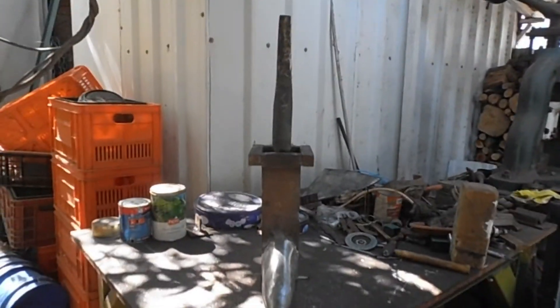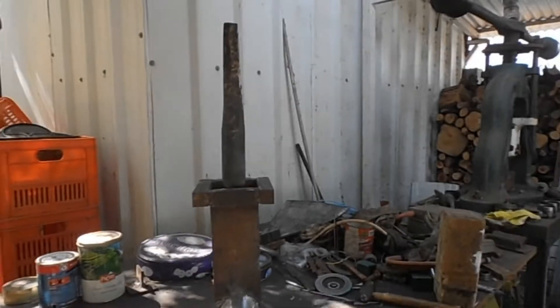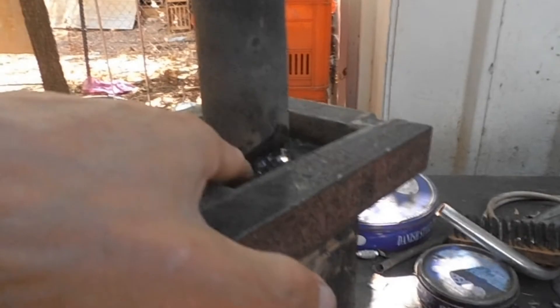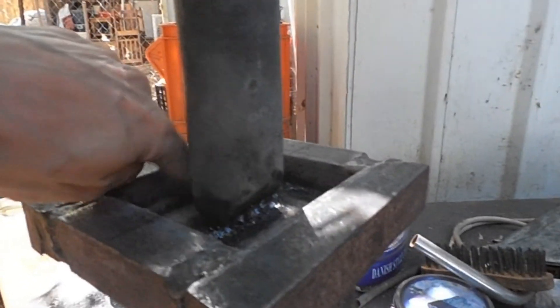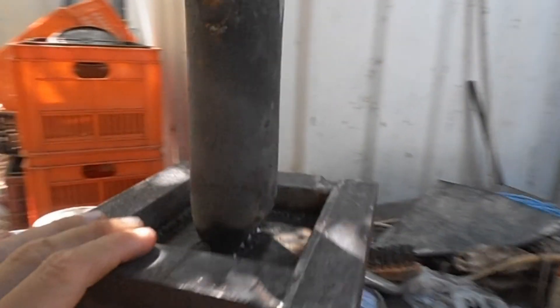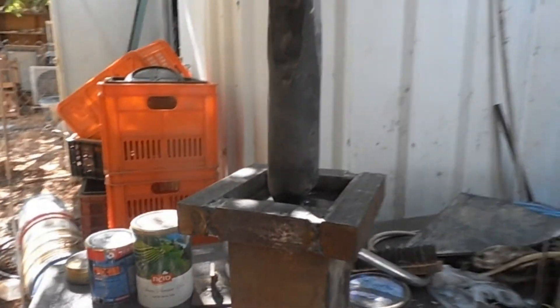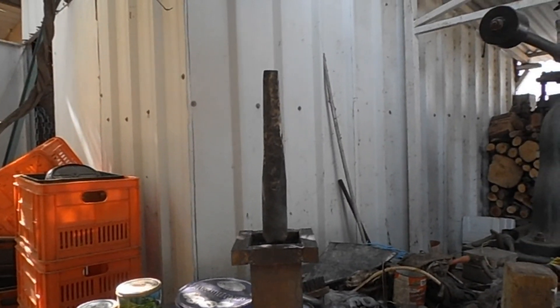As you can see now, it's also not symmetrical here in this spot. I'm going to weld it over here — I cut these two chamfers so all of this space is going to be filled with weld. The root pass, as always, is with the 6010, and then all the rest is 7018. And if something is too far out of the way, you always have the possibility to place it in the forge and straighten it.